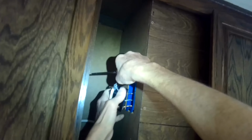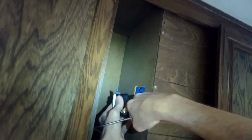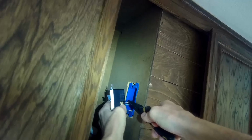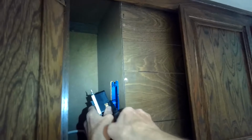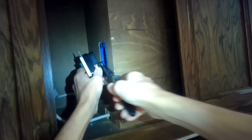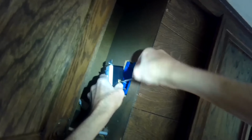Now we have the load one, the black one. That's going to go in where the brass one was. Either one of those holes will be fine. Get this ground one out of the way. And again, this is a little bit of a cramped arrangement here. So I got my needle nose pliers. They're going to help me to get that to go in nice and deep. That's great. And I'll go ahead and tighten that up using a flathead screwdriver. A Phillips head would work too.